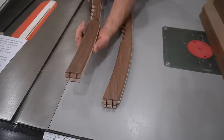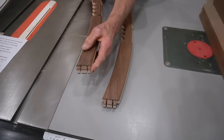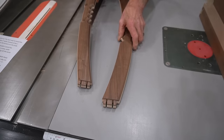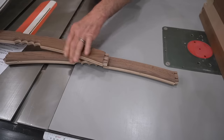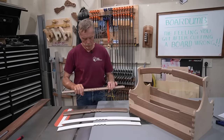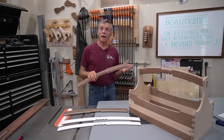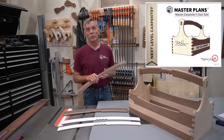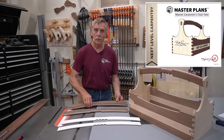Another way to get around this problem on an 1¾-inch wide handle is to make the mortise and tenon smaller and shift the position of the tenon in relation to the top of the handle. But I chose to go with 2-inch wide handles because they not only cover the mortise better, but are also more comfortable to hold, especially with a tool tote full of tools. Fortunately, all viewers need to do to avoid the embarrassment I feel is to use the altered dimensions shown here and in the available PDF plan set when going through the rest of the handle making steps that follow.